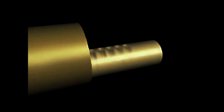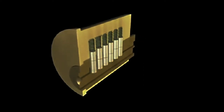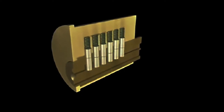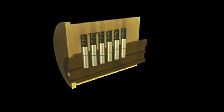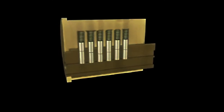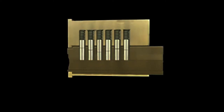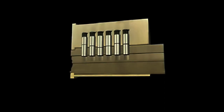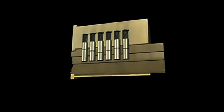This outer cylinder is called the hull, or casing — this half remains in place and does not rotate. Inside you can see the pin columns. Although many pin tumblers have five pin stacks, the number may vary depending on the quality of the lock. Every pin column consists of one spring and two pins. The top pins are usually the same size and touch the springs and the bottom pins. The bottom pins vary in size to complement the shape of the key. They touch the top pins and rest on the keyway ward. The pins are pushed down by the springs — the ward prevents them from falling out and allows the key to slide under them.